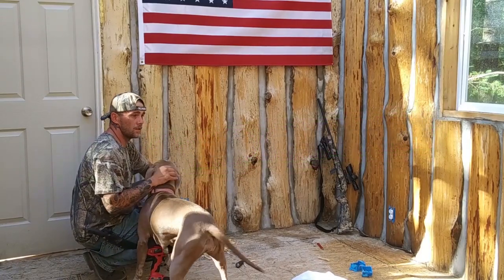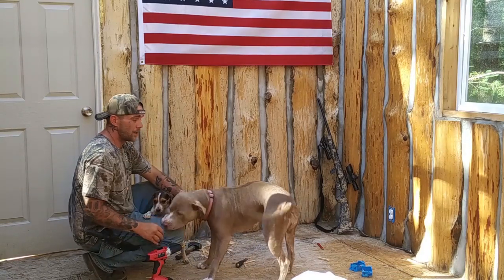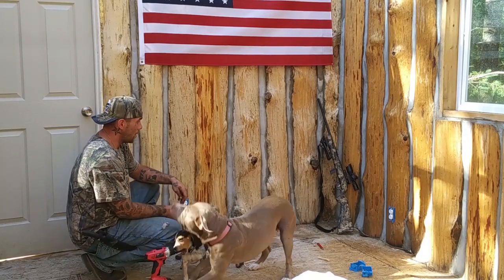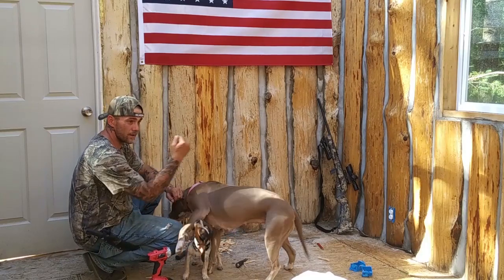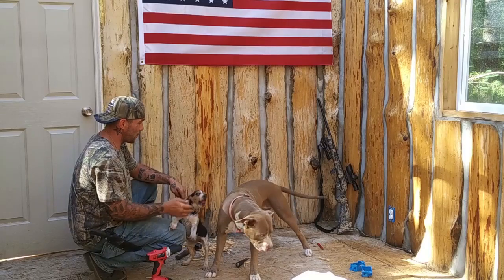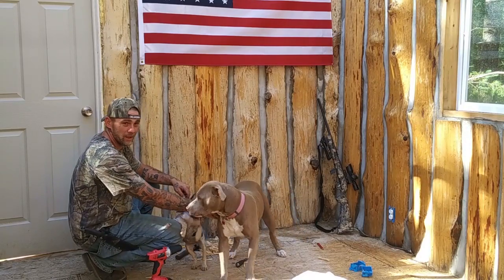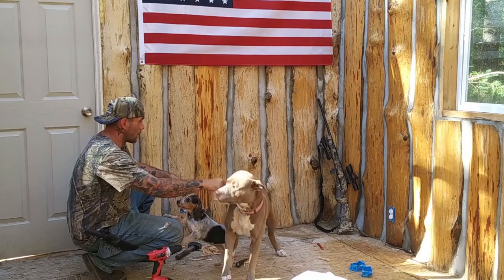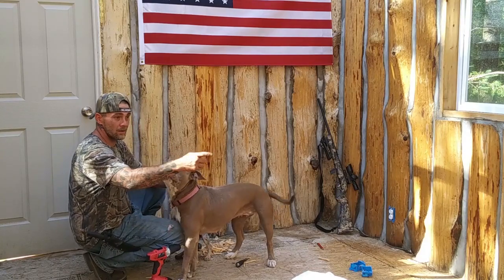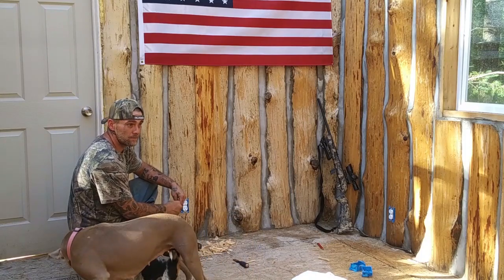But instead of doing all that, I'm just gonna take my drill bit and drill completely out the back of the log, which will save a lot of time. And I'm just gonna run the wire out the back of the house. It's just gonna be a small speaker wire, probably 10 gauge, maybe 12 gauge wire. Don't need a lot because everything's gonna be ran on 12 volt. And just run it down back underneath the house and piggyback all the plugs off of one another so the whole house is hot when I have the solar panels hooked up.